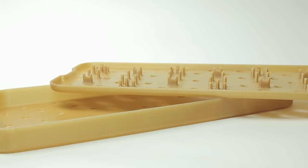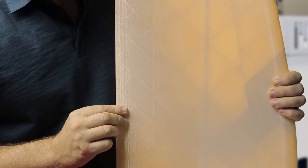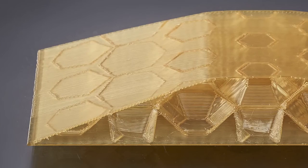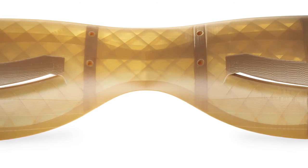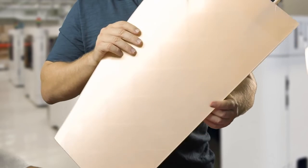When using either of the Antero materials, try to use self-supporting angles of 43 to 45 degrees to reduce the time and material cost of printing. This will also allow you to build complex geometries without the need to manually remove the breakaway support. When printing inner channels, use a triangle or diamond-shaped profile to make the most of the self-supporting principle to ensure a smooth and completely hollow interior. This is particularly useful when producing things like aircraft structures and hollow wings.